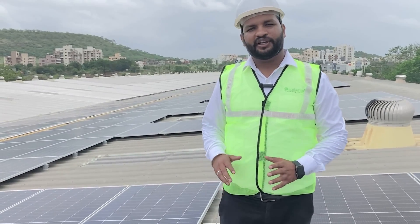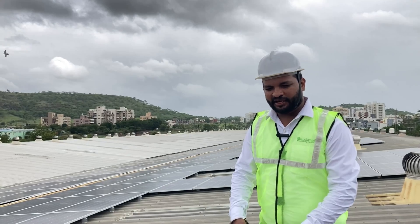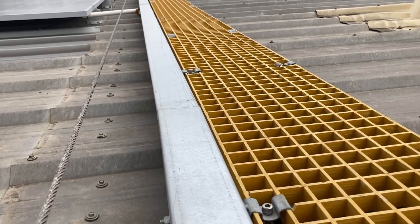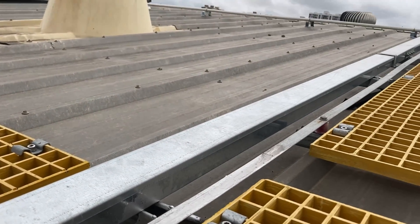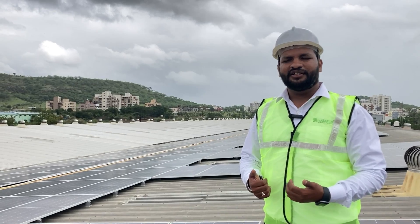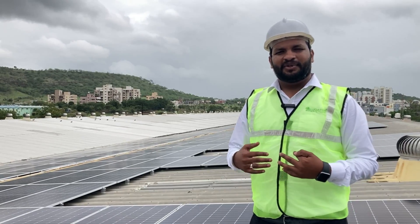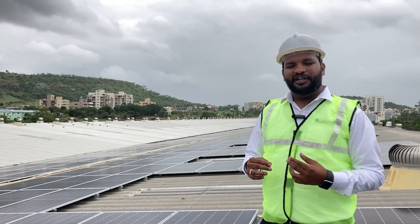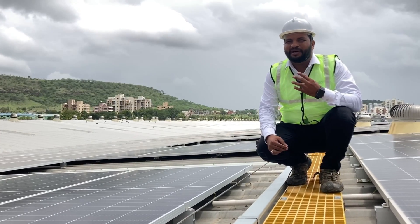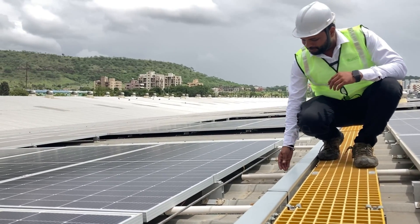To remove leakage or damage to cable, we trace the DC cabling, which is our string cable. We take the cable through a cable tray up to the inverter. This is a perforated cable tray and it is galvanized. The main use is that we can route the cable and protect it from insects or rats that could directly damage the cable — a small but important detail.